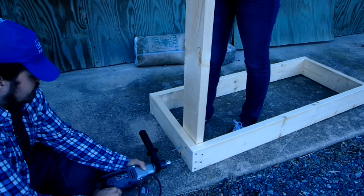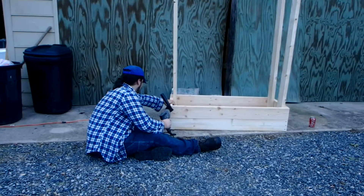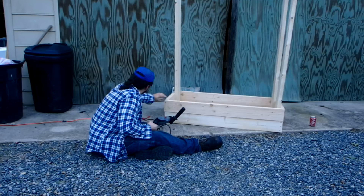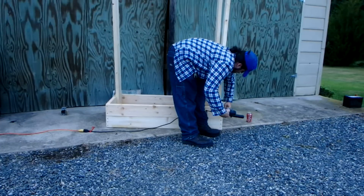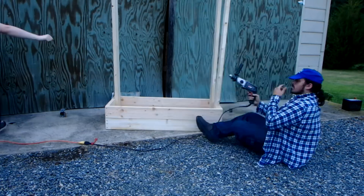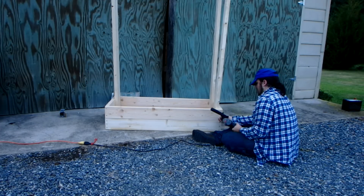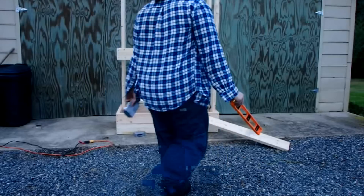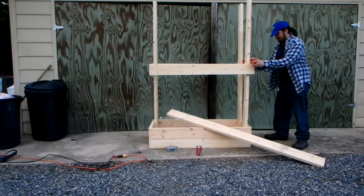Right now you can see I'm putting the risers on the aquarium. This tank stand is overall 72 inches tall. I double-plated the bottom not because it's more structurally sound, but to get that 75 off the floor a little higher. This stand was intentionally first designed to hold three 75 gallons high — it's an evolution of my 55 gallon stand. I took concepts from that and evolved upon it.